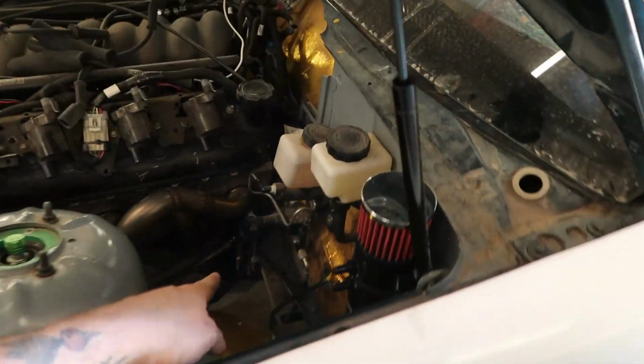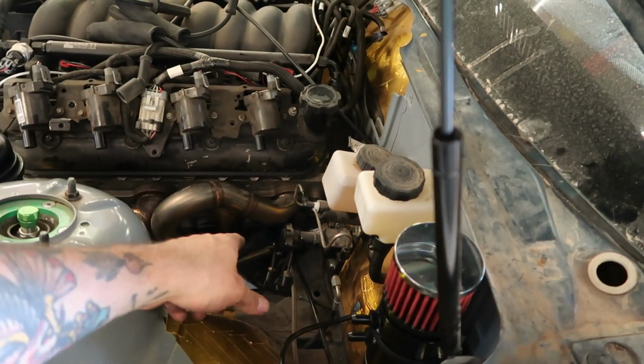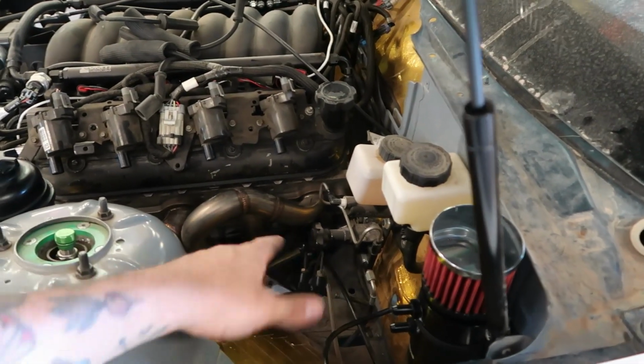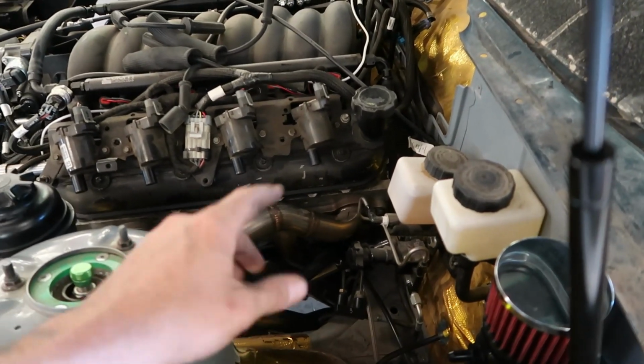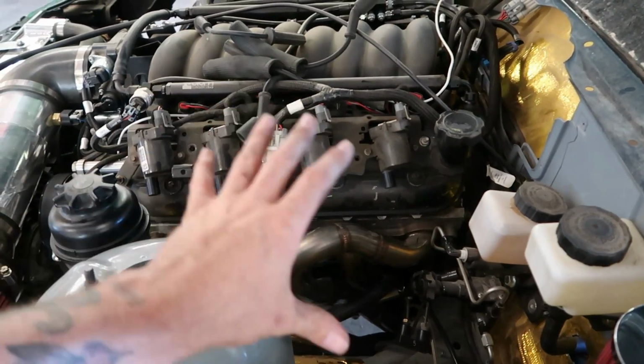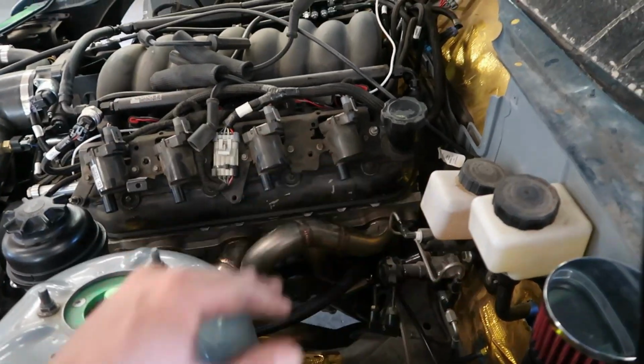He has an oil cooler here, and it goes down to where the GM oil filter block is, right above it, where the factory cooler would be, or block off, whatever. The AN line's leaking. He couldn't get it too tight because he had done the headers first, so I'm going to unbolt one side of that V-band on the Y pipe, and I'm going to loosen these. I'm not trying to remove the header because the steering shaft goes through it. I'm just going to try to drop it down so we can get up in there.